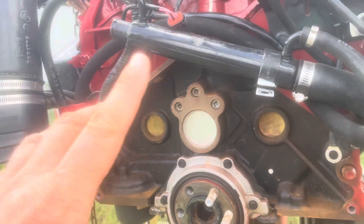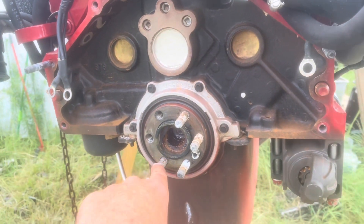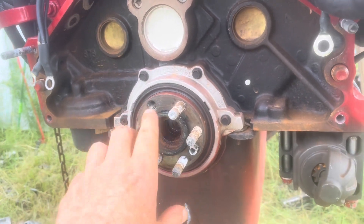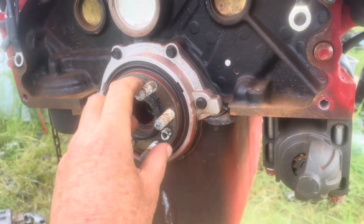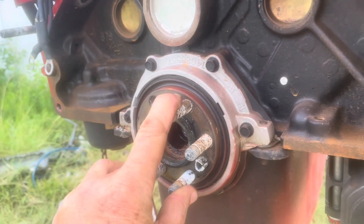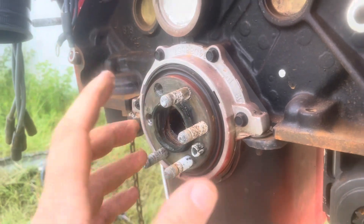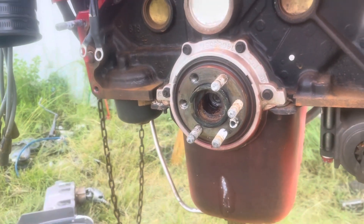Just got the rear cover off, the coupling, and the flywheel off. Volvo Penta uses studs in the crankcase flange, and two of the studs came out, but the other four are stuck in there and it's not worth trying to get them out. Getting on the long block, so I'm going to leave these studs in there and order new studs — just not worth my time. So if you're working with a Volvo Penta, you might want to go ahead and order some flywheel studs ahead of time.